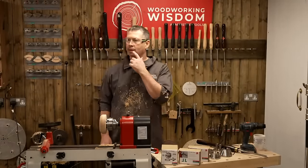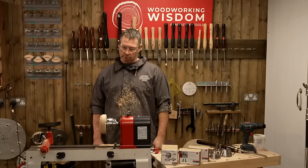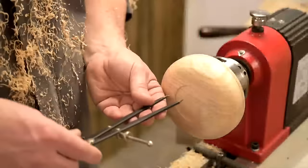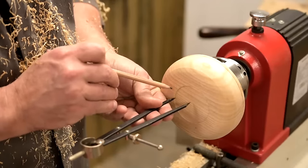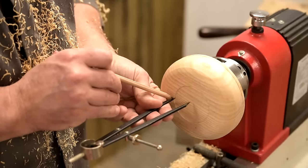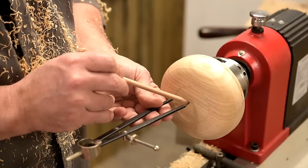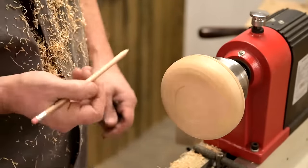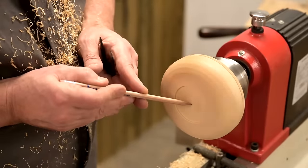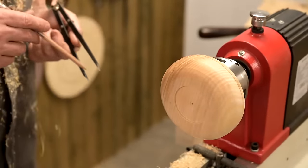Angling Coach, a total newbie, has asked: did you use both points or just a single point when marking the tenon — how do you centralise? When marking, you hover over the centre point. You don't want this point too close to the timber — this is your cutting one and stays down on the tool rest. This is your scribing cutter — that hovers and scribes. If you accidentally go right of centre, everything on the right is travelling upwards and that would cause a problem. That's why we only hover at centre. If you're unsure where centre is, do this with your pencil — as soon as you turn the lathe on you can pretty much see centre. Pop a little pencil dab on there as a focal point.